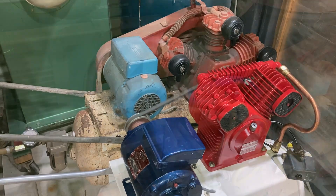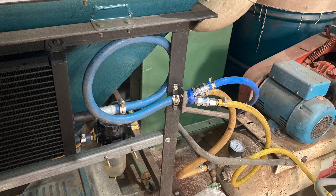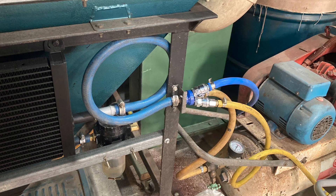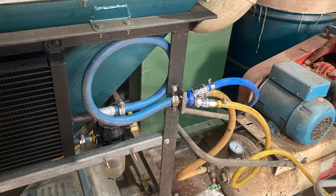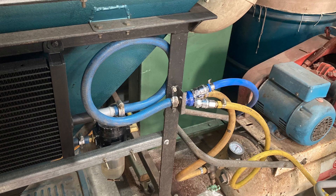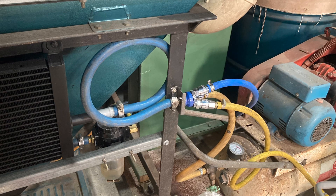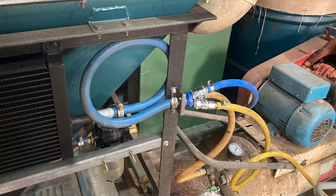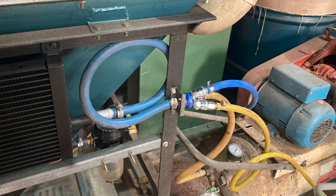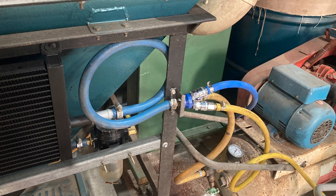This is the business end of how all the air comes together. It looks like a dog's breakfast but it's pretty straightforward. The two yellow lines are the inputs — one from each compressor. The blue line on the right goes back to feed the rest of my workshop. The blue line on the left with the big loop: the air from the compressors goes through that line, through that radiator system as an after-cooler, comes back through the water trap, and off into the sandblaster.